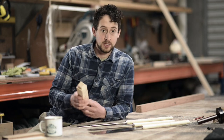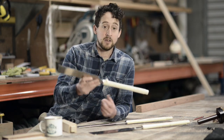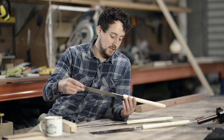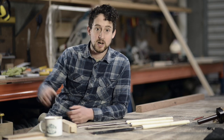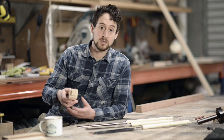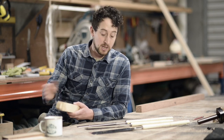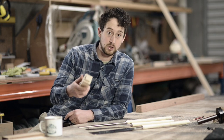Compared to a large machine, these are actually really affordable and you can do so much with them. If you get good and quick at using a Japanese hand saw and some nice chisels, you can do your work anywhere — even in the lounge room. You don't need dust extraction, and you're not going to be annoying your neighbours or housemates with noise. They're really lovely to use, a really nice tactile way to work, and compared to Western style saws, these provide a really nice clean, super fine cut.